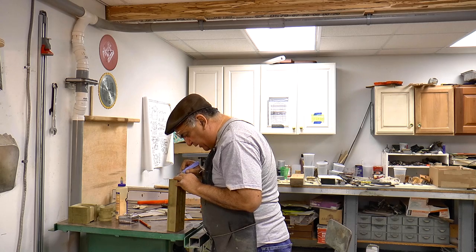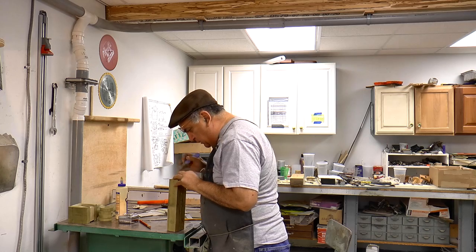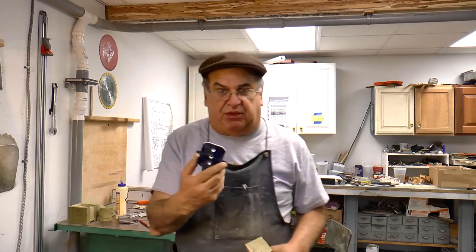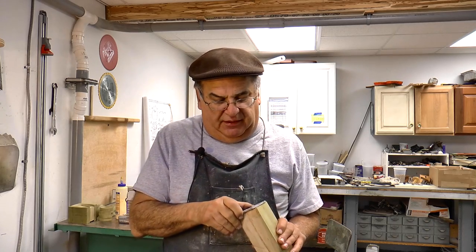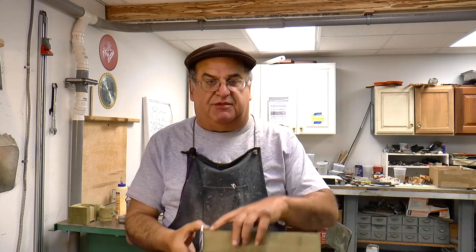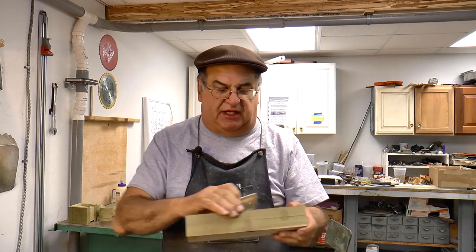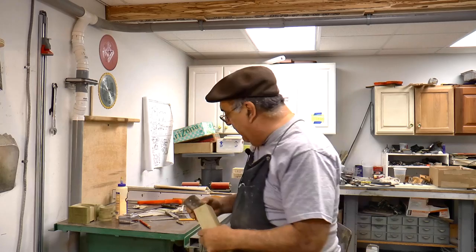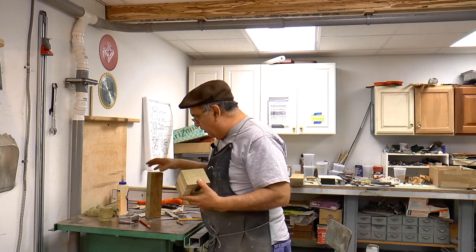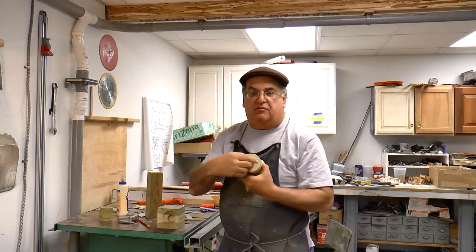You put the marks on there. Now I'm going to put this plate on the end. I don't want to make another plate — this will work. I'm not going to turn this part here; I'm only going to start right about here and turn down between the jaws. I need the center section. What I'm making — so we get clear — is part of this. I need to make core prints that match these round pieces here.